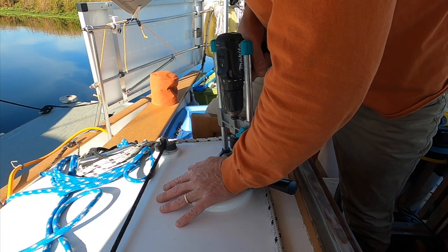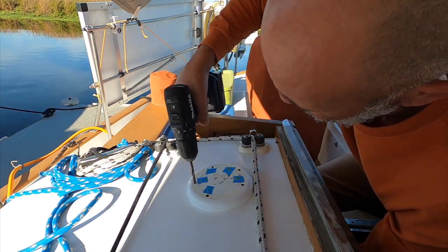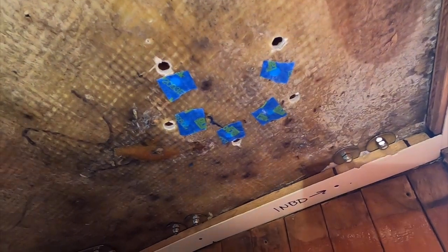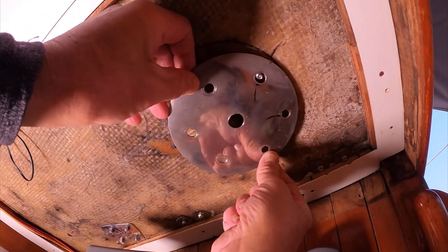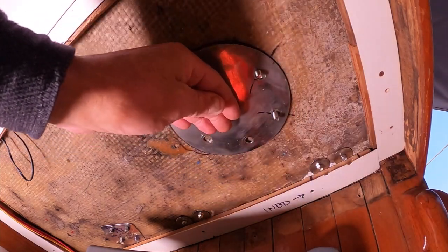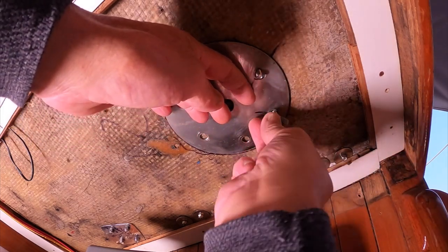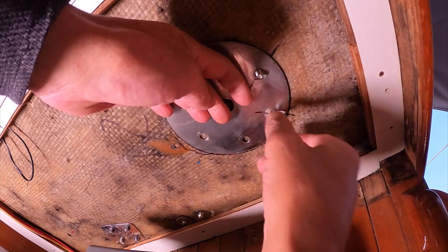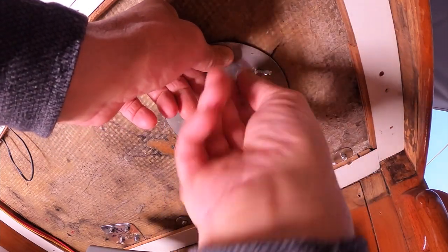I drilled the new footprint for the new winch and hogged out all the coring at each of the winch holes. It's kind of hard to see, but you can see where I created a little bench in there. I'm going to tape these holes off and fill them with epoxy, and then tomorrow I can drill them out and mount the hardware. There are five bolts on this winch base — two of the holes lined up with the backing plate, so I'll use those with a couple of flat washers. I'm just wing-nutting it down to lock it in place so I can drill the other three holes.